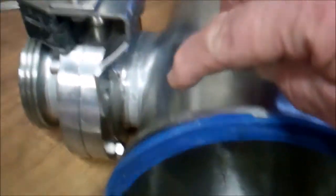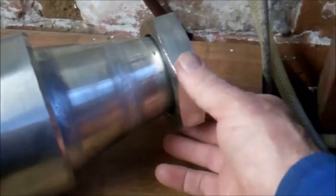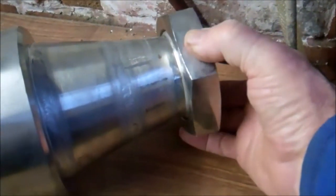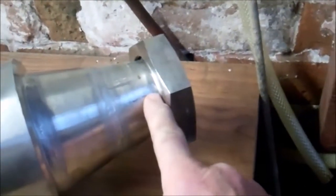These are the valves that have got to be cut off. They'll be cut off where that weld is. And the other end - this is a two and a half inch female fitting and it needs an inch and a half male fitting, so it needs a cone reducer from two and a half down to one and a half. Same on this one.